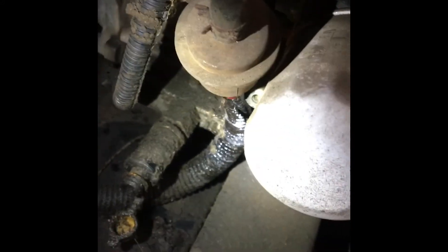What I found here is a leaking hose at the base of the fuel filter. It's cracked real good — it goes right down to the fuel tank. We're going to replace the whole thing because you can see it's all cracked. I'll see if I got a new fuel filter and throw that on. It's just running right out right now. The thing probably lost prime, and I guess overfilling it right up to the filler neck made it so the fuel level was higher than the filter.